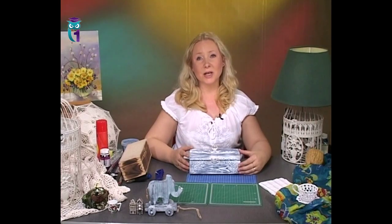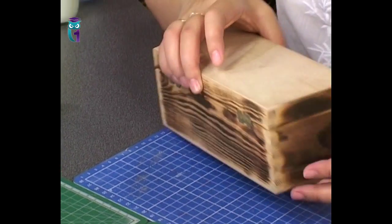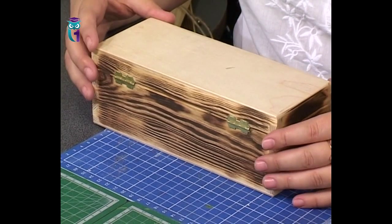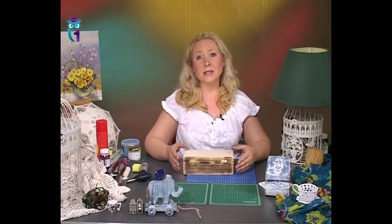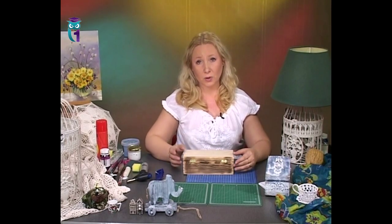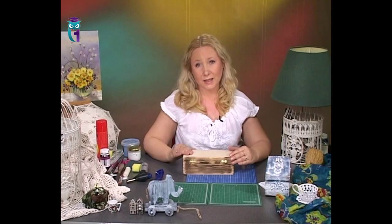So that our casket becomes wonderful, we begin with the most interesting process: preparation of the wood for work, in this variant, by roasting. At once, I warn you, don't try to do this operation in house conditions, as first, open flame is dangerous, and secondly, it will be difficult to clean the smell of burnt wood and soot from the house. Therefore, I suggest you go out of doors, put the product on the earth, on sand or on a metal railing, and take pleasure in work with a gas torch.